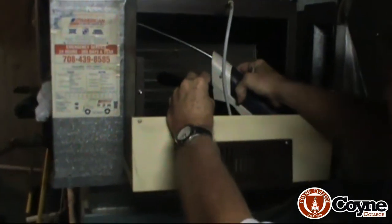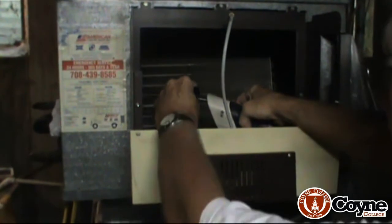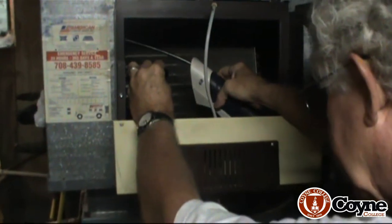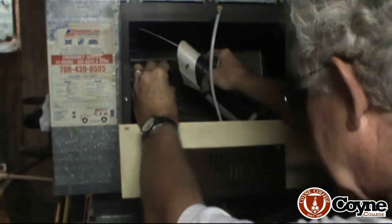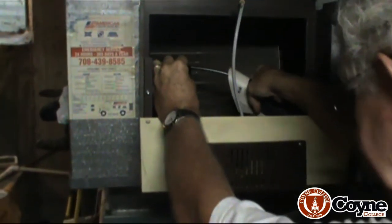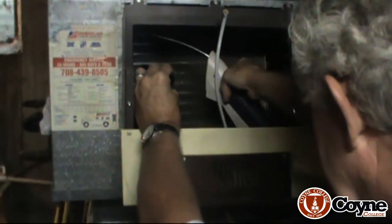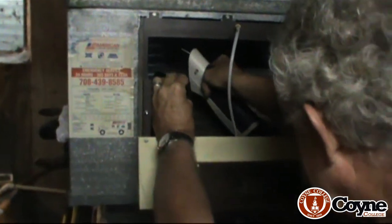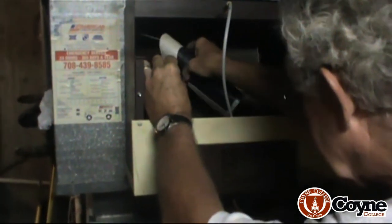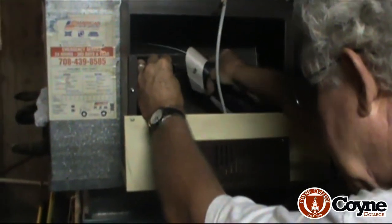So we're just taking our time and going down the line, because if there's a leak, this baby's going to find it. I'm also physically looking at the copper in here where I can see it, because if there's a refrigerant leak, there'll be oil there — the oil goes along with the refrigerant. I've seen oil spots in the middle of an evaporator coil, and that will clue me into something. It is 25 years old and many of these evaporators will have leaks on them.